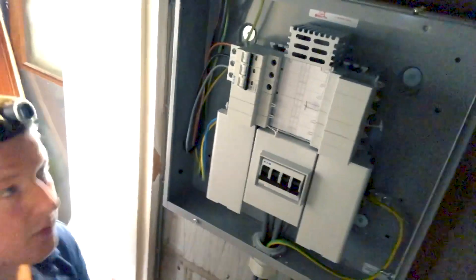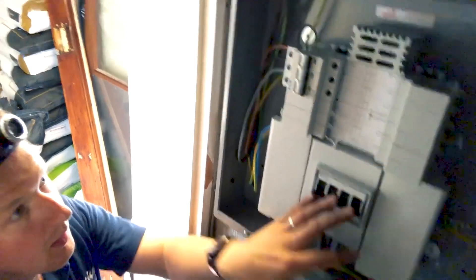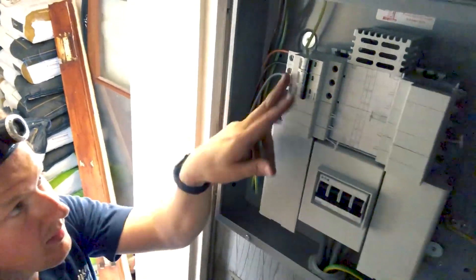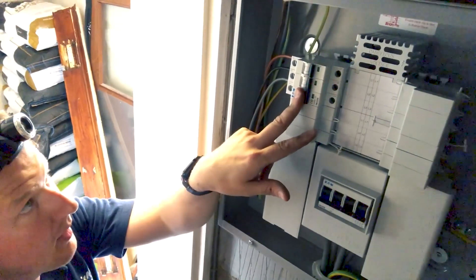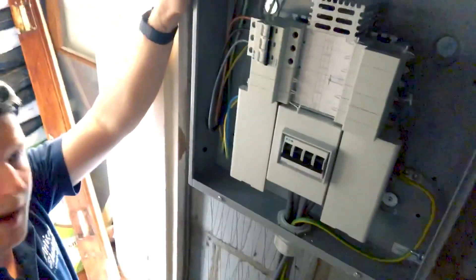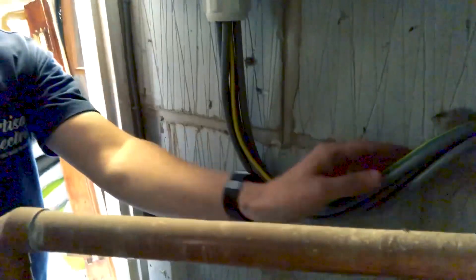Here it is - the board is in. Main switch, four pole, three spare ways. This is the circuit for the socket I've installed - you can see I've done the earth nut up there. I'm pretty happy with how it went. I've got my tails coming out of here, going along, with one metal clip there just to secure them through the wall.